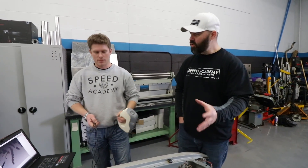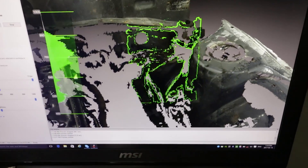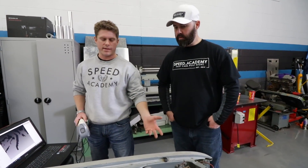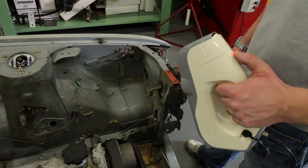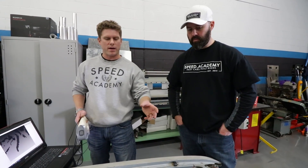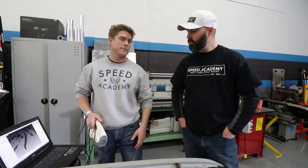The scan is a true-to-scale three-dimensional model, replicating what's in front of them down to the micron — capturing parts, flanges, surfaces, nuts, bolts, everything. It even picks up texture in the valve cover. Some might ask why not use CMM, but for the amount of reference information needed, the white light scanner is much faster. It's very accurate, gathers a lot of information at once, and allows Jay to get it into SolidWorks and start designing a header pretty quickly. Jay has now finished scanning Connie and is figuring out the computer design.